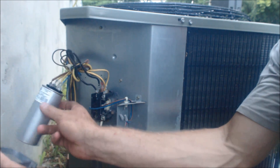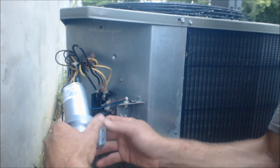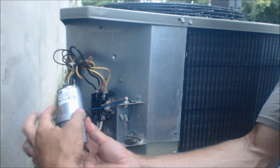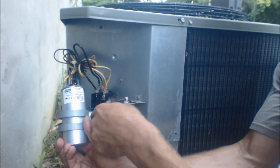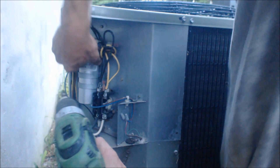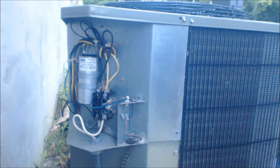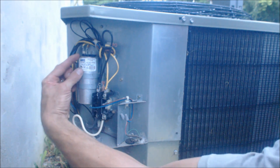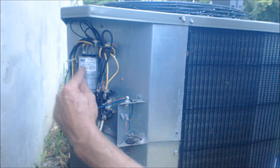This new capacitor is a little bit too big for the existing bracket, so we can bend this and re-screw it in. Some people zip tie them with white cable ties — we're going to end up bending this metal and putting zip screws in. I'd like to do a favor to the next service tech by having the rating plate outside the bracket so they can immediately see if they have the right capacitor in the truck.